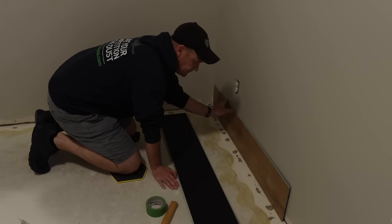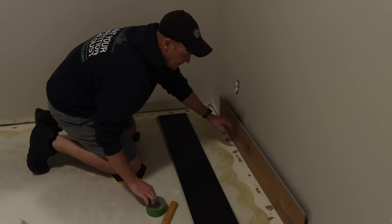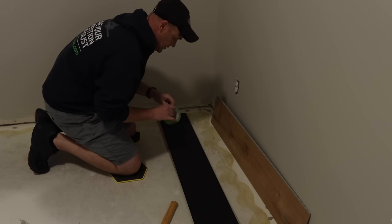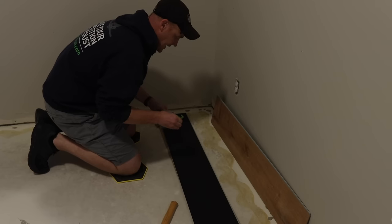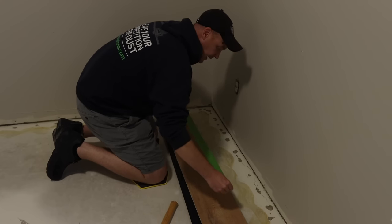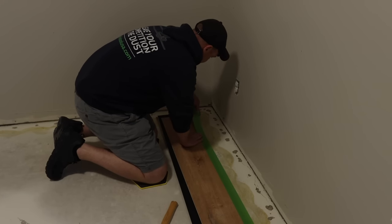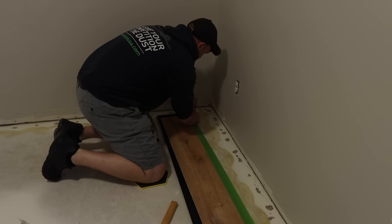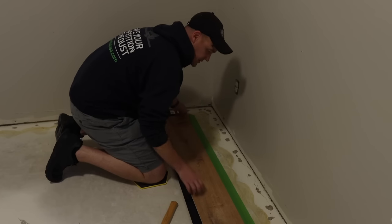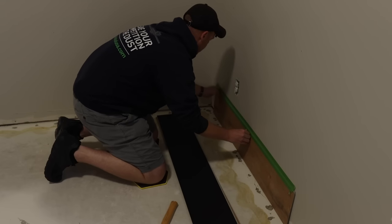Before taping the spacers, I used the hammer to remove a couple of brad nails left from the baseboard so the pieces sit flat. I tape the spacer pieces upright against the wall — they'll come off and actually get used as flooring for the room. This is a lot easier than managing small individual spacers which just fall down when you knock a board into them. Once you get five or six rows down with some weight to the flooring, the spacers don't even need to stay up.